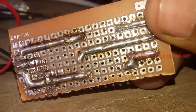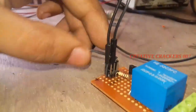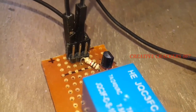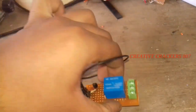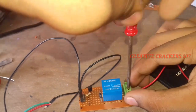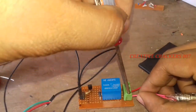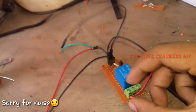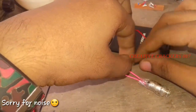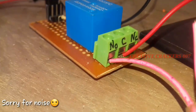The work is fully completed — now it's time for testing. I have connected the three pins: first the negative pin, and the next two are positive pins. It is connected to a battery eliminator which can give up to 12 volts, but I have chosen 5 volts because the relay used is only 5 volts. Now choose one pin — either positive or negative — and connect it to the common pin, and take a 5-volt bulb and connect its positive terminal to the normally open pin. Connect the remaining terminals for the bulb and the battery together. Don't use 240 volts because it may injure you.